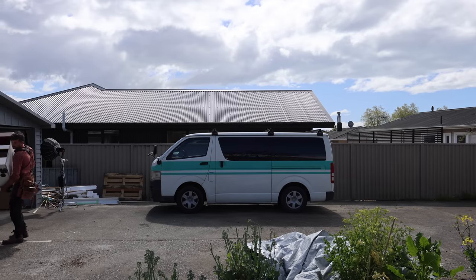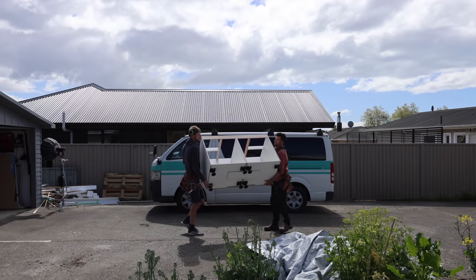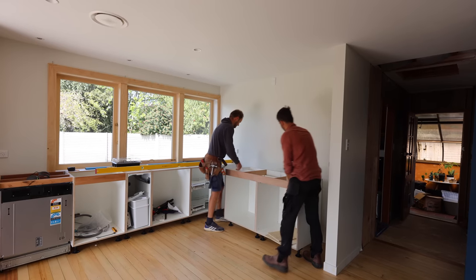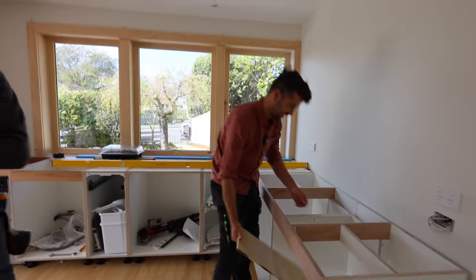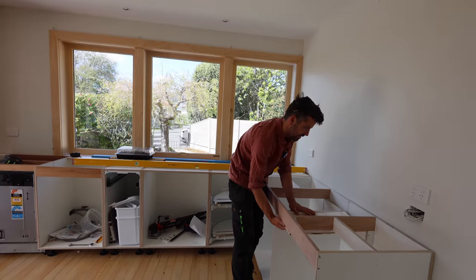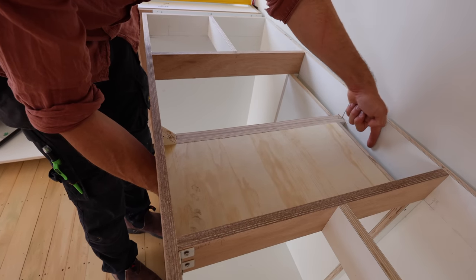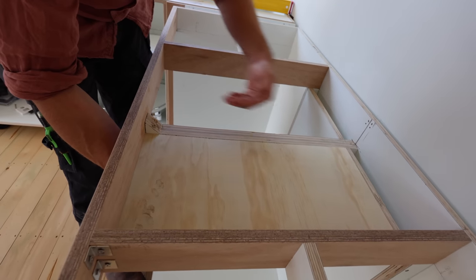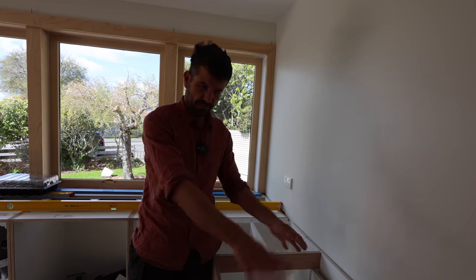Don't forget to breathe. So that's the centre. I can take it from there. So the plywood that Ray's been cutting goes under here like that, and that creates an enclosed area. And then you have a vent down here that the cold air will be sucked up. And then we're going to put a nice router slot through here that will allow air to escape. And then all the hot air produced by the fans of the induction cooker will have somewhere to escape, and it won't get all in the drawers.